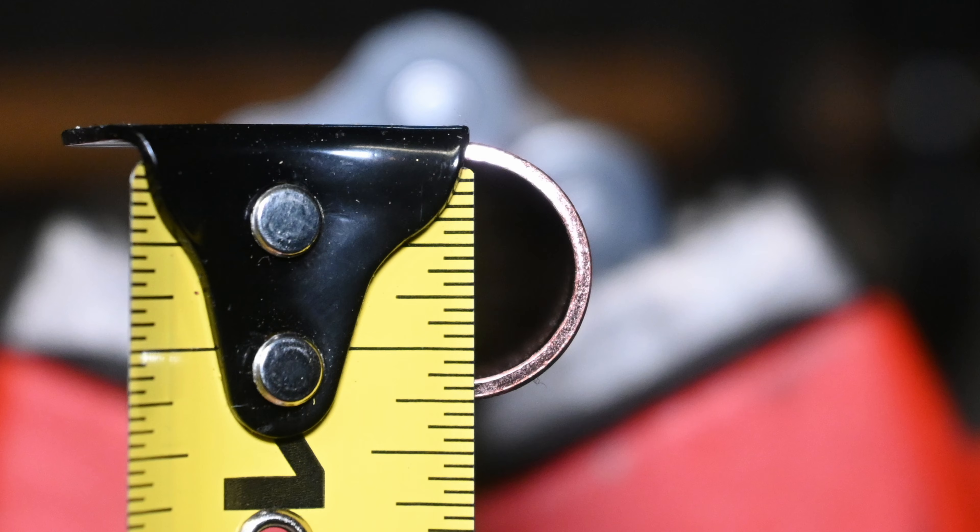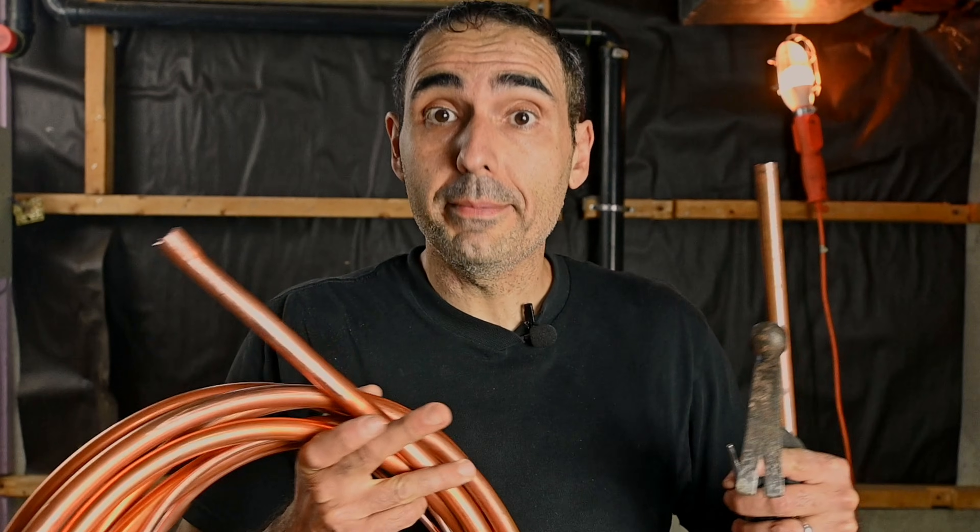Remember, you're turning a plain-end piece of pipe into a hub. That hub needs to accommodate the outside of the plain-end pipe. So for half-inch, the swaging tool will likely refer to it as five-eighths inch, because that's the equivalent outside diameter of half-inch inside diameter copper pipe. Same thing goes for three-quarter — if you're swaging for three-quarter inch inside diameter copper pipe, the swaging tool size you're looking for will be seven-eighths. Also note: you need to swage for the same size you're connecting. You cannot swage half-inch pipe to accommodate three-quarter inch pipe — it's against code. If you take half-inch pipe, you swage it to accommodate half-inch pipe, and so on.